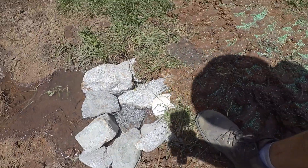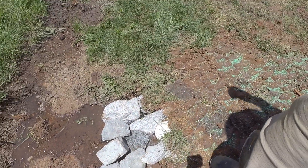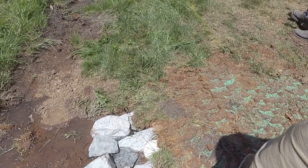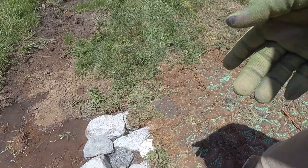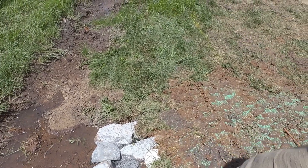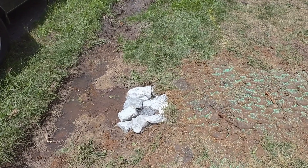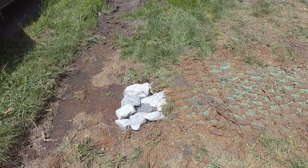Remember when I was talking about your existing drainage system and I said it should be gushing? Yeah, that's what it should do — that's just the hose. When it's really raining that thing should just be dumping. Every time you see water coming out of one of these pipes, that's water you no longer have to deal with.